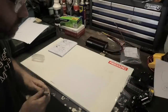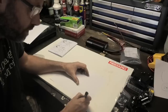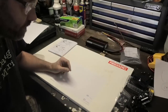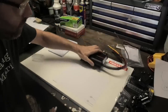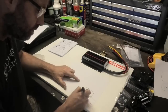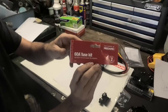Let's have a look at the DC board and what it will start to look like. If we start planning this board out, the first thing I want to do is just have a positive and a negative terminal coming from a battery — really just moving those battery terminals onto the board about a foot — and then from here we're going to branch off. We'll have the loads where we're drawing current and the Redarc charger where we're putting current back in, and they both need to be fused. From here we branch off to a fuse twice — the fuses Redarc supplied with this kit are 60-amp fuses.